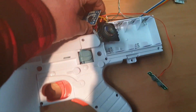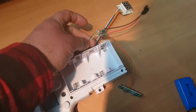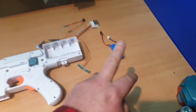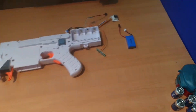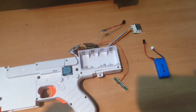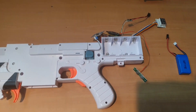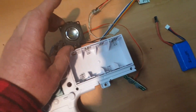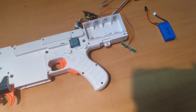You've just got to be careful with the circuit board that's lodged at the top. I have put in a voltage regulator — it's a buck converter, so you can adjust voltage up and down. I've put that in so it drops the LiPo voltage down to six volts to run the internals. I did try a small amplifier and a few different speakers, but none made a significant improvement. I settled on this little metal-domed speaker, which gives a bit more volume and handles it better.